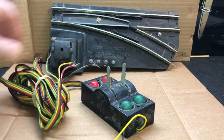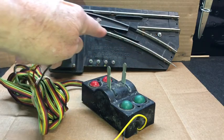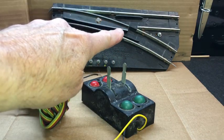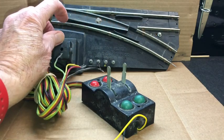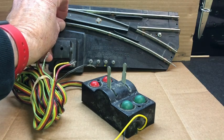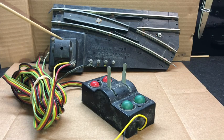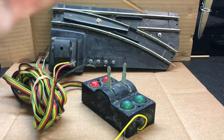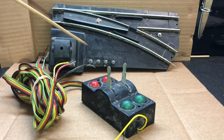For example, I've had switches where when the train is traveling along the curved section, some of the drivers — either on a steam or diesel locomotive — will collide with the switch right there and actually move it just a bit. The same can be true in the other direction, because the tension on the spring is not correct. So in addition to filing down the frog points, I've had to work on the spring, which involves rebuilding the solenoid and plunger. I spent a good deal of time adjusting that spring.